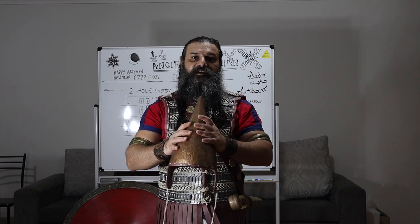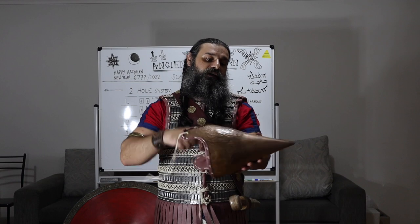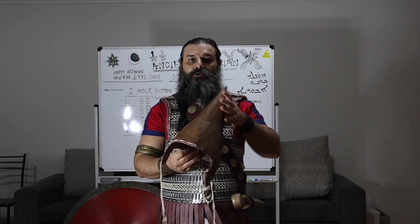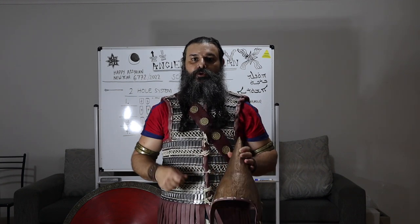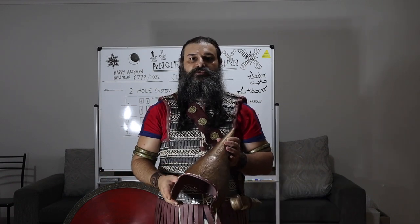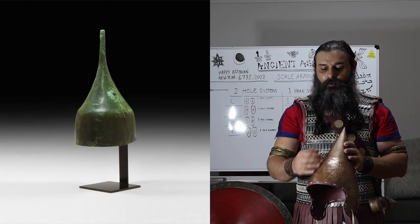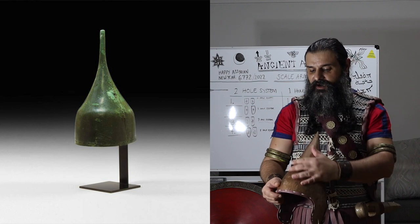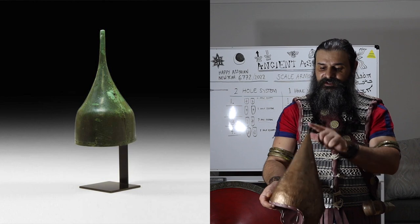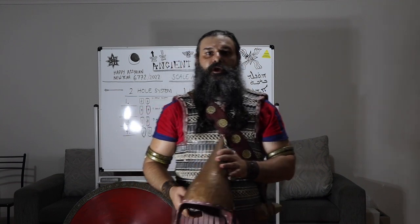And also, if they can create a flat sheet of iron as well, I know the template to cut it out to then work it, so that we can get this shape as well, with a simple seam down the back, instead of having to raise it all out of one piece from the center, working your way out, which is also another method that ancient Assyrian helmets used. And there is also another method from the archaeological evidence that shows that they were made in two halves, with the split running down the front and the back, and they're soldered together. So you get three methods of construction for ancient Assyrian helmets.